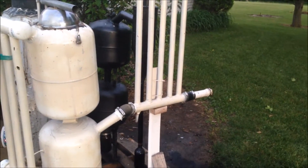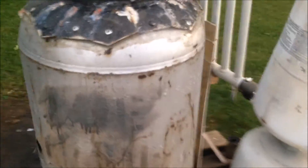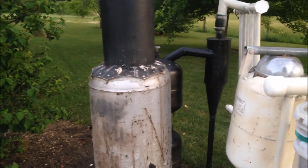My next problem is not using heat resistant paint and silicone. Look at that paint coming off. Paint over here burning off. This silicone right here completely black and charred. The paint and silicone up here is heat resistant up to 500 degrees, and so is this silicone — 500 degree silicone — but it's kind of peeling off after that test run. I ran it for over an hour and it got really hot. So that just goes along with the first thing of just cheaping out.